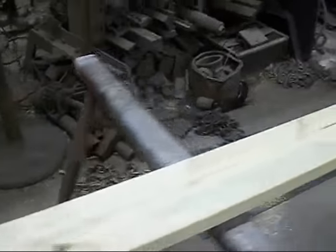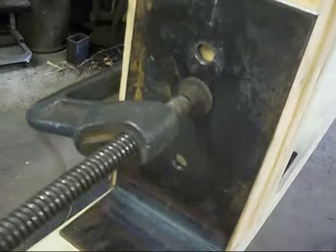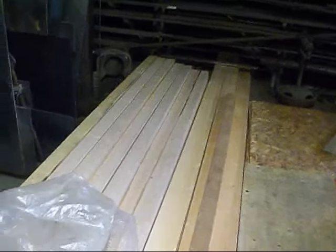I think it's about 26 outside today. But I made a little mock-up of how the beam works. I have these plates made on this side to bolt in through bolts there. And then these will be lag bolts going through the sill plate, down through those holes. Anyway, that's kind of the way that works. So let's go outside and take a look. There's a lot of building material. Some of these are already pre-cut that I already made, ready to go on. Lots of 2x4s, 2x6s.